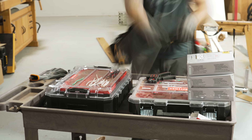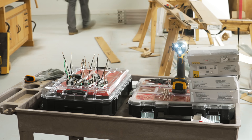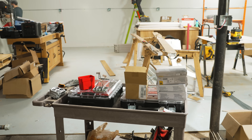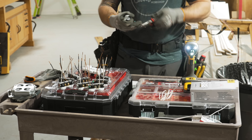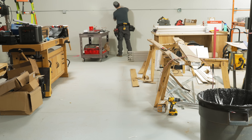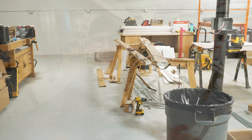Next I went ahead and made up the boxes. I had a whole bunch of outlets to deal with and had to use some new outlets since I ran out of the ones I pulled from the old shop. I made up a whole bunch of pigtails, attached them to the outlets, got those attached to the face plates, attached some Wago connectors to pigtail the outlets together, and then finally installed them on the boxes. Anytime you can batch out things like this it makes the work go a lot faster than trying to do them one by one.